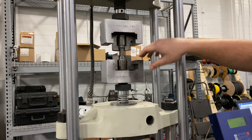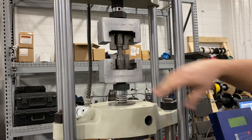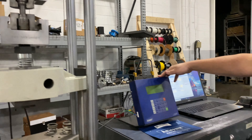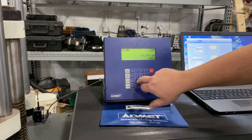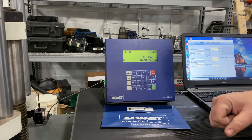Right now you can see the hanging tooling and grips for that specific size specimen. For this setup, we have an EP2, which is taking all of our data acquisition. Right now I have it set up on method 2. For this specific specimen type, I have it saved under method 1. So we're going to go to test method, select. Now we're in method 1, which is set up for the three-quarter diameter specimens.